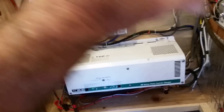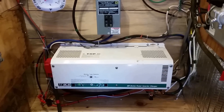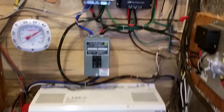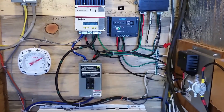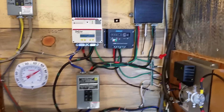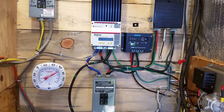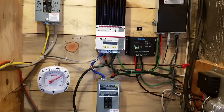All of the boxes in here, everything is grounded. The solar panels are grounded. So if there is a short, it won't sit here and cause a fire because it's going to trip or blow the fuse. Now I would never deliberately set out to install a system where everything wasn't in conduit. This was done on a shoestring budget out of pocket. It's safe because it's grounded.